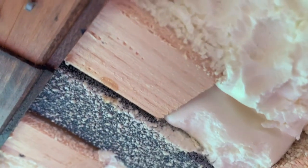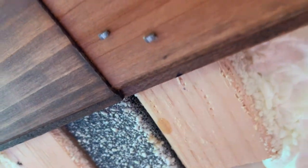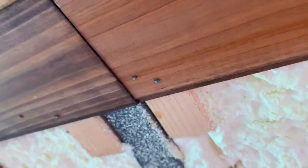So if you did your furring strips the way that we did, where you put them on the sides of the channels, and it has to be separate pieces because of the curve, you might run into this issue. When two ends of boards meet together, either the tongue or the grooves might not quite match up perfectly because your furring strips might not be perfectly even. So whenever we notice that it's not matching up perfectly, we won't nail the ends of those boards in all the way or even at all until we get to the next board. So that way we can move them around a little bit more and match them up.